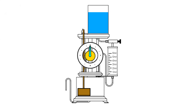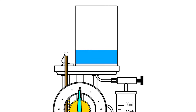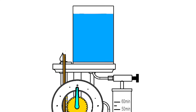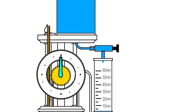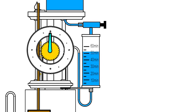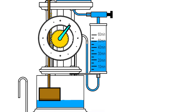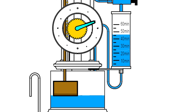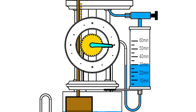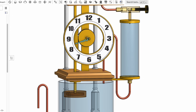It's kind of like the old versions, but there's some differences — they kind of mix-match everything together. As you can see at the top, you have some sort of reservoir; this is just to keep the water in the system. This will go through a valve that we can regulate to make the clock tick faster or slower. Then what I would call the hour container gets filled up until one hour, and with the siphon, the water will empty out and go to the 12-hour container, which has a float. And this float, with the help of a rack and gear, will control the dial that will show us the time. I've made a 3D model just to help me make all of this shenanigans work.